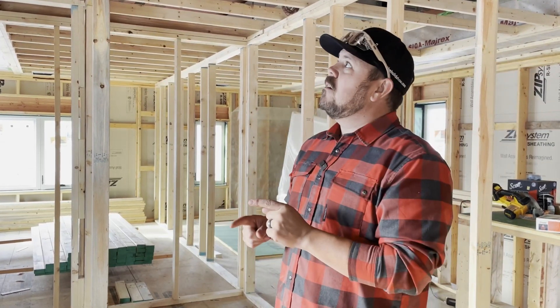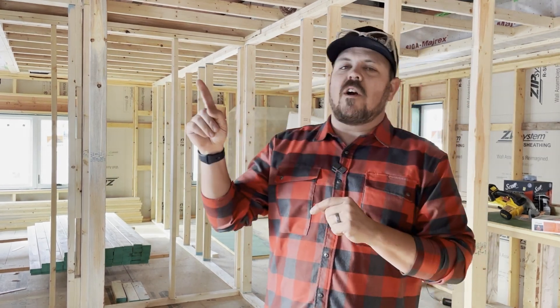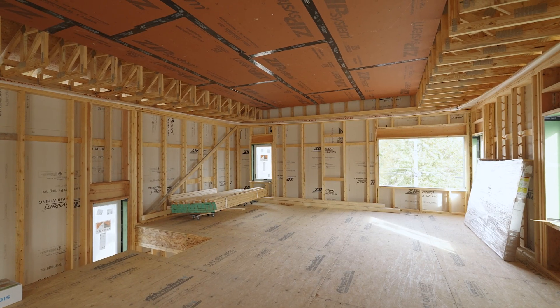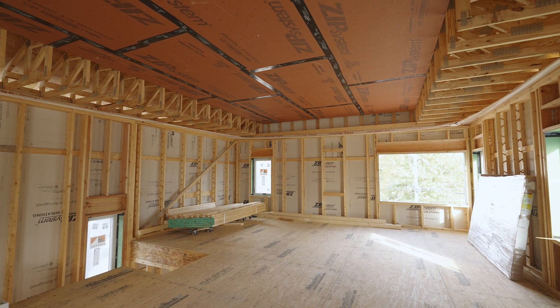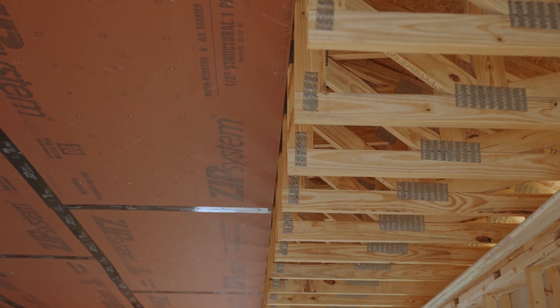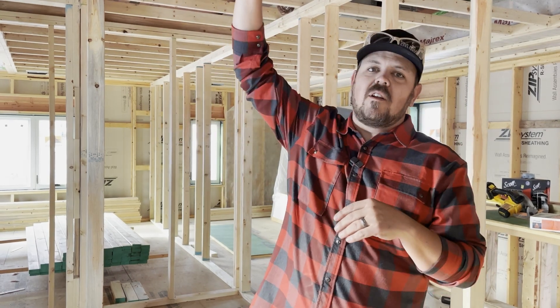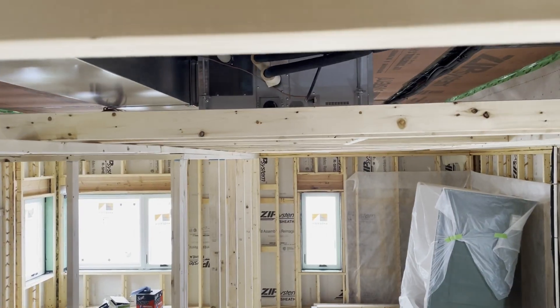What we've done here is we ordered our trusses with a plenum in them — this is a straight gable truss. The trusses come in on both sides for about three feet, make a vertical change in elevation, and then flatten off again. The ceiling up here will be flat when we're done. You can see we've already started to infill frame some of that plenum.